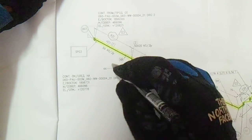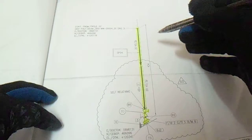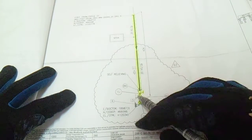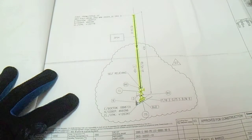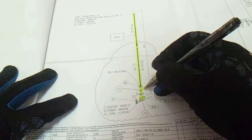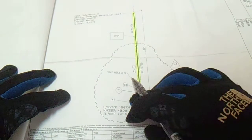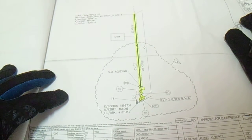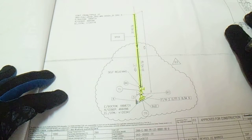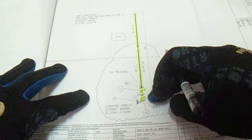And this is also a joint. Check also this joint, and we have a continuation. So this drawing too will go from the continuation. Okay, we have a valve here, so this is a gate valve. Okay, check from here, from the description, if this is the correct orientation of this hand wheel. Also check the code number of this valve, the size, and we have also the pounds there, and the type of materials, if this is carbon steel or stainless steel, the type of valve.